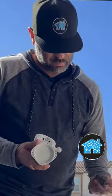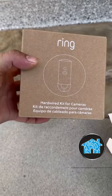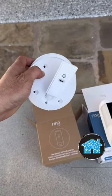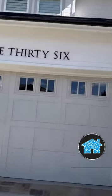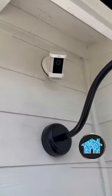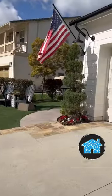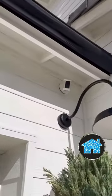Inside of it, it also has a built-in rechargeable battery, but the rechargeable battery is there as a secondary backup. With home technology expert, we hardwire it primarily with power using hidden wiring, so it's always recording with power and you don't have to recharge anything. But the moment that it loses power, it will go to the battery as a secondary backup, so in those emergency cases, you're always getting recordings off of that camera.